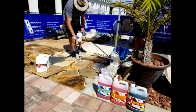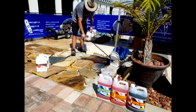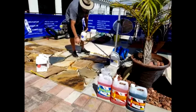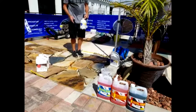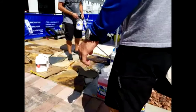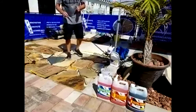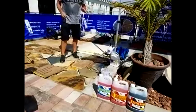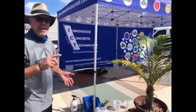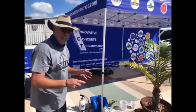It's going to enhance when it's wet. We can come back to this in about 15 minutes and it'll be dry. This is almost dry enough now that I can take the towel and wipe off the excess. The reason why you're doing this is to protect the stone from mold, algae growth, and the sun deteriorating the surface — it's going to make it that much easier to maintain and keep clean.